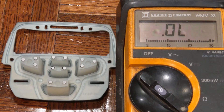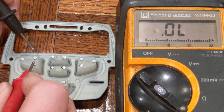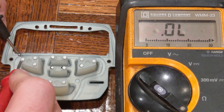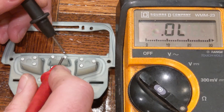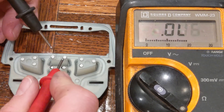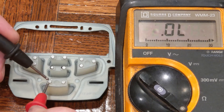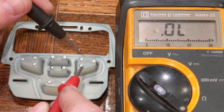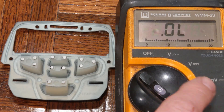The conductive repair has had a chance to dry, so I'm just going to test these out with a voltmeter here — you can see they're highly conductive now. One problem with these buttons is there's just a very small amount of contact surface. It's a large button, but when you really look at it, it's not much contact surface. These look good, so I'm going to go ahead.